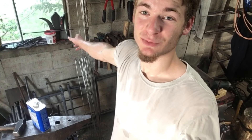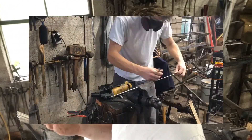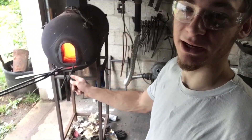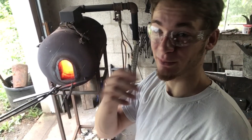It is dripping hot out here, but I have all of it done over there, which is really boring. I assure you we'll be forging at some point, but it's very important. I'm hoping that since I haven't baked it on yet, that'll be the end of it, but we will find out in the morning. Good morning. So let me get you caught up on what we have. I have all my pieces here — cut them off with the angle grinder, which was probably going to be the fastest option. Didn't really want to snap them. I have my forge hot, and I have this bar sticking off to the side so I can put them in at an angle, so hopefully they stay cooler and I can hold on to them. But let's get to forging.